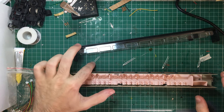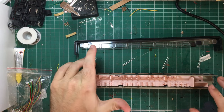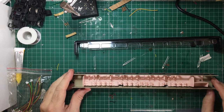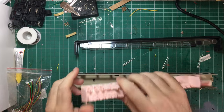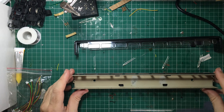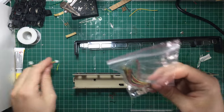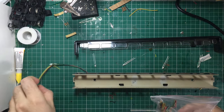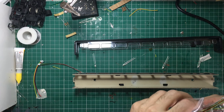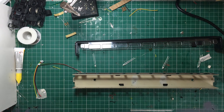I'm making sure that when it's all back together the lights are going to be roughly in the right place. I am expecting to get a little bit of a pinpoint above where the lights are, so it's important that I put the pinpoint as close to where the real lights would be in each carriage. I'm probably happy with them sitting there — that should be about right. Now I need to drill some holes in the base ready to take the wires.